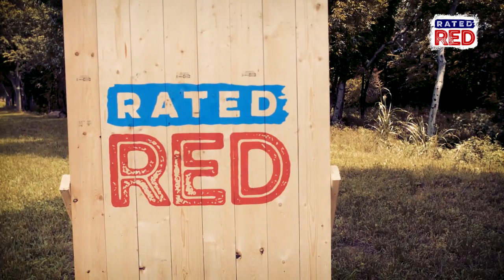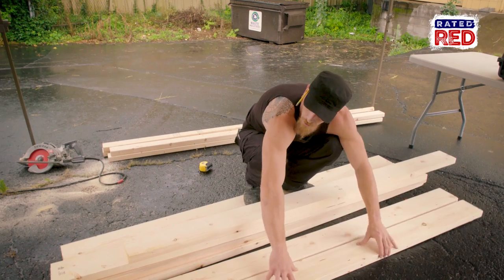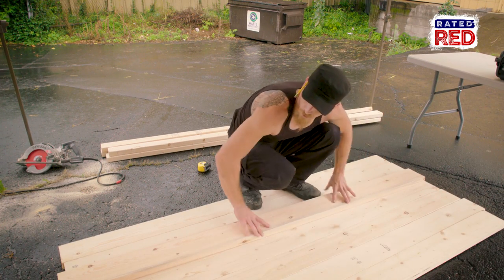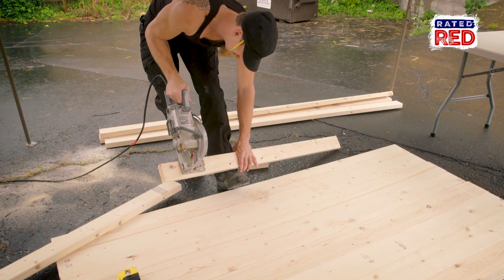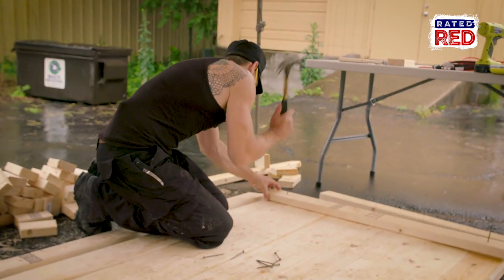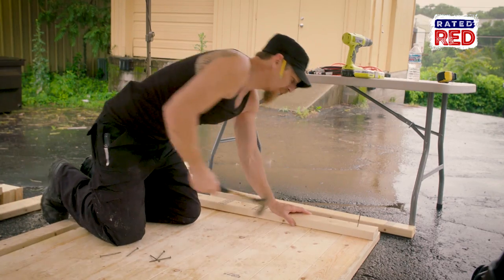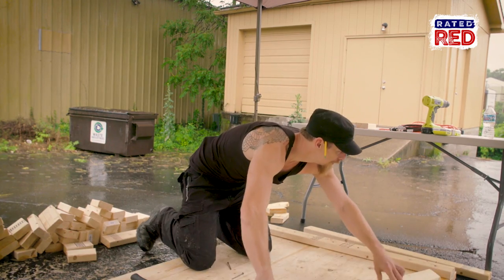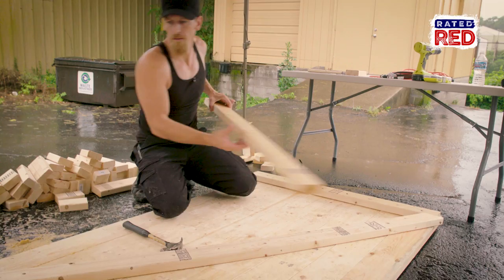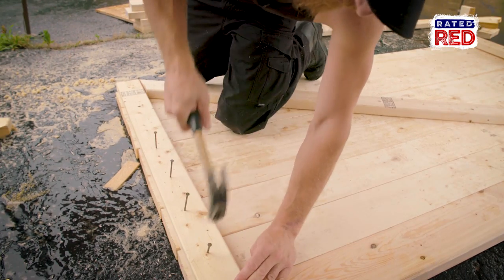So these are all pretty simple targets to build. I'm just using two by eights, cut them down to seven foot so it's not so much taller than I am. Basically what we do here is set this up like a wall. A lot of times they use targets like this for stage throwing. Have you ever seen silhouette throwing when they throw around people? These are real nice because they're mobile. They don't last forever but it's nice and easy to build. What I like to do is put a Z brace in here, and this just holds it laterally so it don't fall apart. Basically all you're doing is laying these out seven foot, building the frame for the back.